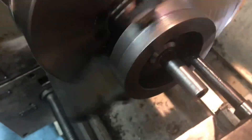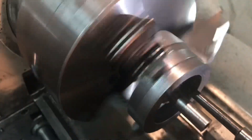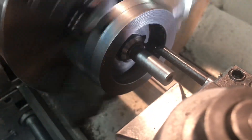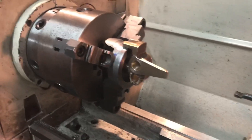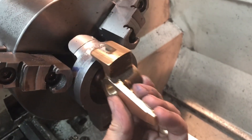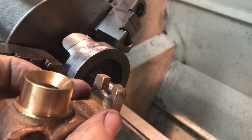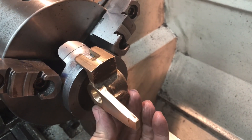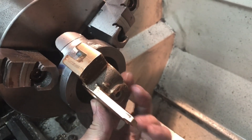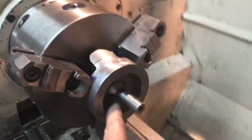My lathe light is not the best, so I've got a little flashlight here - I need to get a drop light I can hang over it for detailed work. I'm going to stop videoing right now so I can put all my attention to it. I'm going to get the cone cut all the way down to the 45. I finished turning the outside - I had to file down a little bit so that this part would clear and I could check and make sure that it seats. It seems to seat nicely in there. I've taken off a couple of extra cuts just to make sure it's fully seated, and I don't dare take off anymore. I think we've got a nice 45-degree cone here.